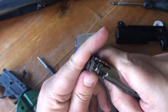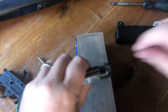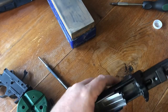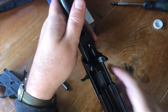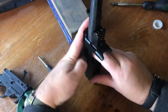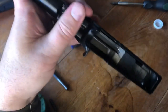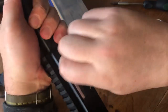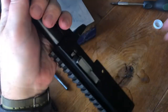I'm not sure I've really taken enough off of here to improve that, but we'll see if it's a little easier to put back together. For reassembly it just drops in with the bolt charging handle in place — yep, so that was definitely easier to drop in than it typically is, a little bit of an improvement there. And as we cycle the bolt it feels like it might be a little slicker. Not sure that's a worthwhile gain but we'll see if we continue to have those jamming issues.